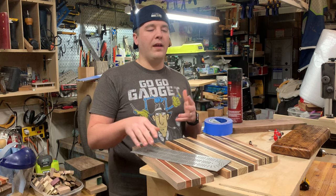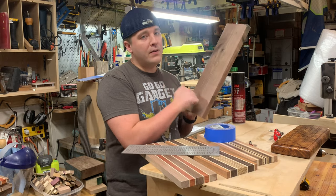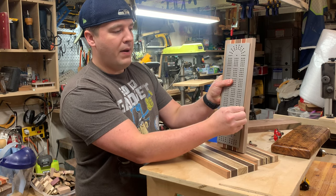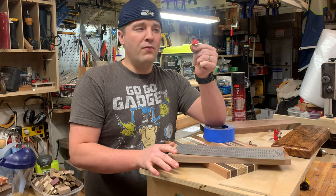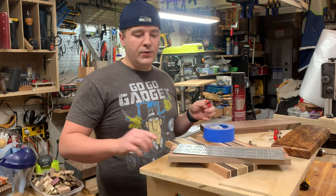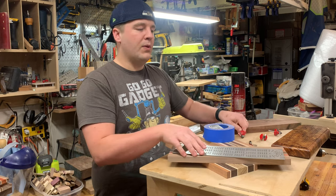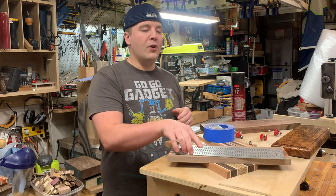When you're planning — whether it's a laminated board or just a single slab — make sure you give yourself a little bit of room. Later on you can account however you want. For me personally on this one, I gave myself a little more room because I like to use the cove and bead bit, which gets a really nice profile. So just plan ahead what kind of edge profile you want to do. If you're not going to do an edge profile, it doesn't really matter — just do straight and sandpaper. Whether you're going to do a chamfer or something that comes in a bit, think about what bit you're going to use and make sure you give yourself enough room. Once you figure that out, you can make your board blank the size you want.